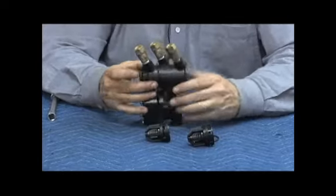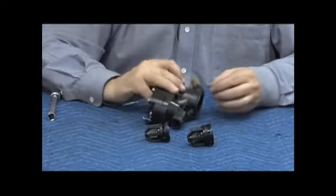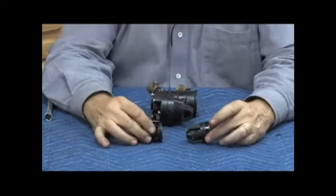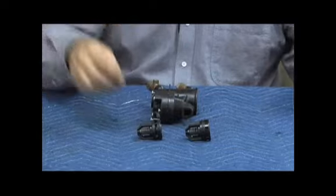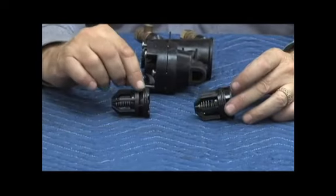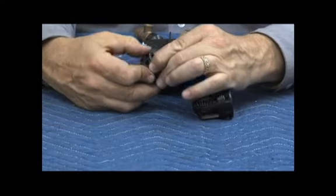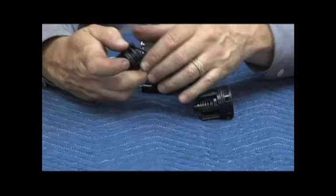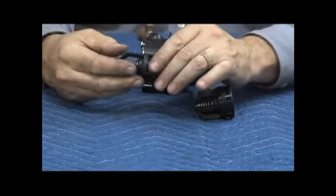There's our second check, and this is the mounting O-ring, one on both sides. Let's talk about the check assemblies first. Check assemblies come out modular, meaning that it comes apart like this, sealed by an O-ring. The O-ring sits in the center of the stem disc, the seat right there, just like that. For proper repair, remove the O-ring, proper lubricant.